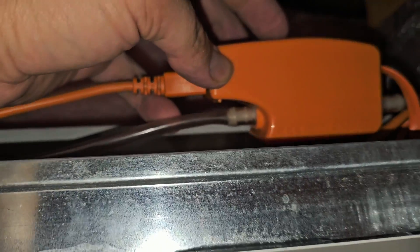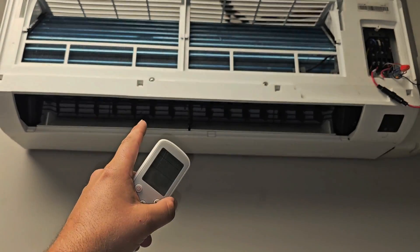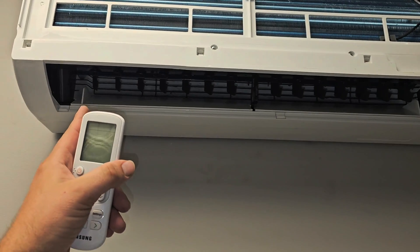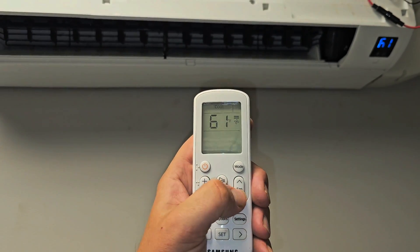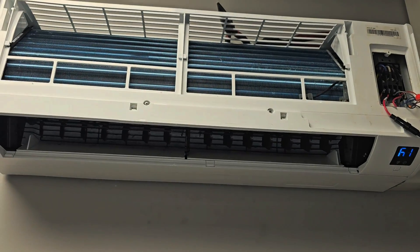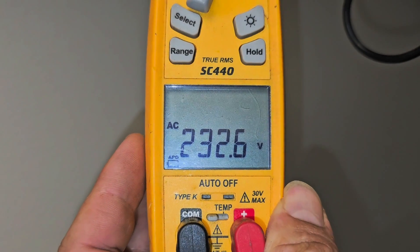I've got the pump temporarily placed where you can see it — whenever we turn it on you'll see the water going through the pump and you'll be able to hear the sound. Next step is to pour water in the pan. Breaker back on. If you ever clean a mini-split, leave the bag on and turn the unit on cooling so you have time to remove residual water from the wheel or the vanes. Let's check L1 and L2 — turn your meter on volts AC. We have 232 volts going to that pump.